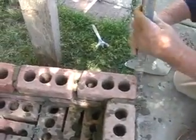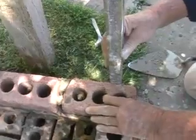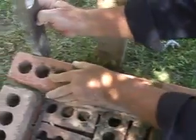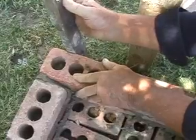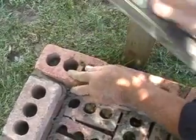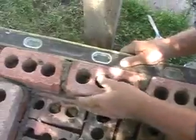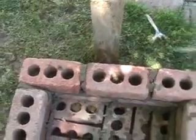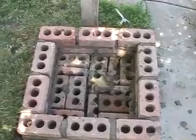And you can see by doing this, by going 24 inches by 24, we have no cuts to make. The same thing you would achieve if you decided to go 20 by 20. Now I have the same thing over here. I plumb that corner. Then I bring my bricks up against this level, and we should be nice and straight. Now that's the last side over there.